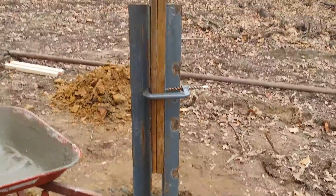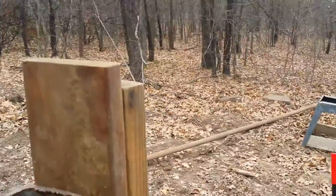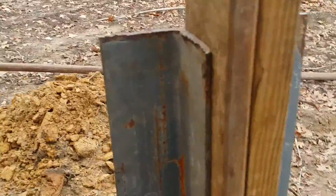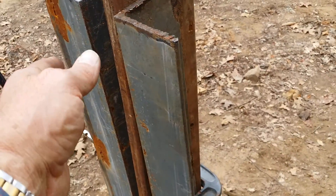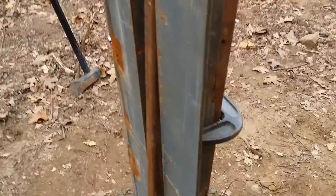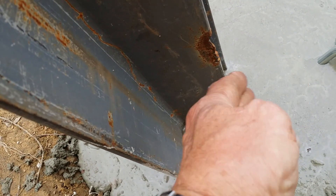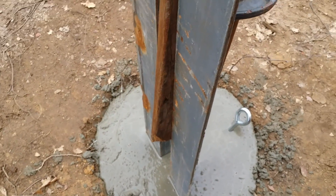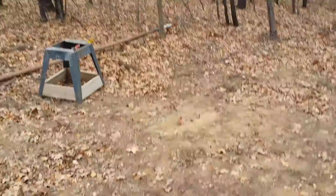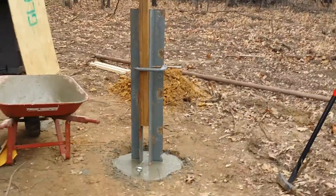That's for later, but for now I've got the main part up. As long as I can get that pole on there and pivot on the one screw up top, that'll be good. When it finally stands up it's going to slowly go down, and on the other side I'll put a backplate so when it stands up it hits the backplate and can't go further. Also on the front bottom I can put a backplate too. Then I'll have three guy wires going off about six foot down from the lower portion of the blades of the wind turbine. That's what it is for now, get back with you soon.